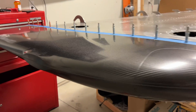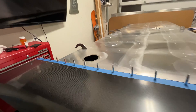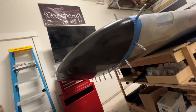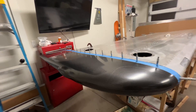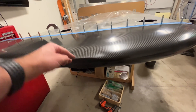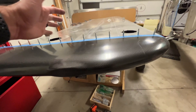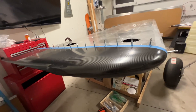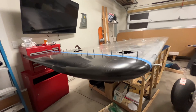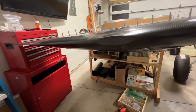Drilling complete. I'll just do the last five at size 30 and the rest will be size 40. Before I sand, clean up, and prep for glue, I think now is a great time to put on the position light — because I'm never going to have easy access to the inside again. It'll have a rib once we glue it. I don't know if I'm going to reach my goal of getting this glued before I leave for a four-day trip over Christmas, but we'll keep working.